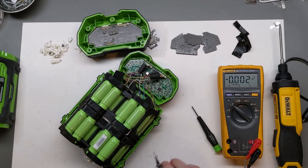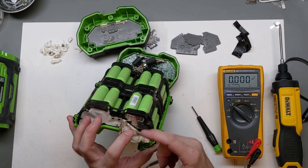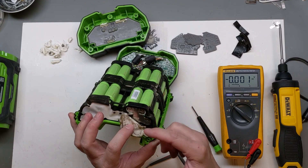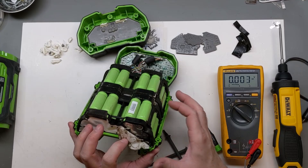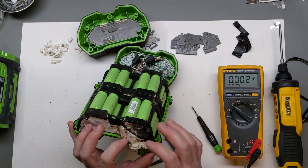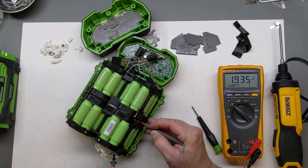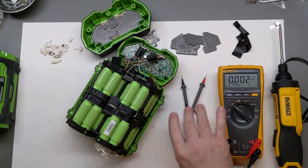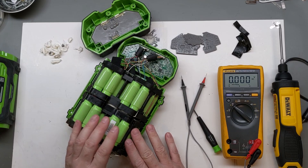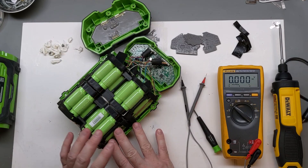We do have an issue with this cluster right here — these two batteries. The way they're in series, it's a cluster of two that goes through another cluster of two in series. Our white and yellow wires are the monitoring wires back to our BMS, helping us find it. This end is going to be minus and this is positive. I'm going to simply boost these cells up just a little bit to see if that's the issue. Sometimes when cells get out of balance there's not always an easy fix, and boosting isn't always a permanent solution.